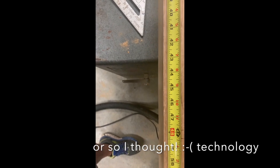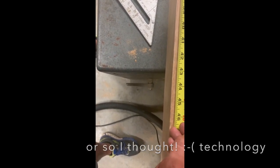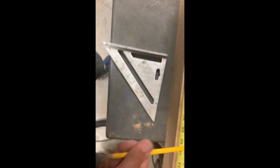And in the bottom, I'm going to move this down because the tenon is going to be 2 3/8. So it'll come down to here. And then another 1/2 inch will come to here. So this will be the top of that top ridge going across there. This will be the bottom of that top ridge. And then the tenon will be a 1/2 inch in on each side. So this will fit nice and secure in there. And we'll do the same thing. Now the rest of them, we'll do the same thing for each hole here.